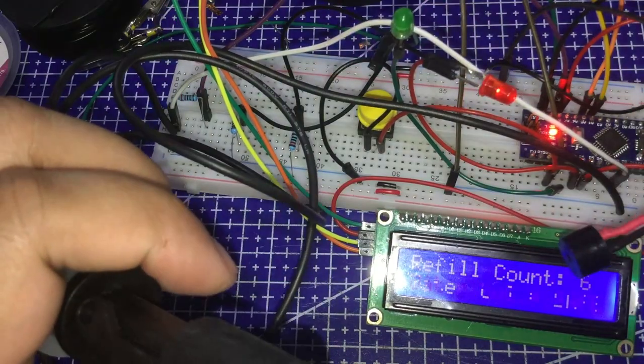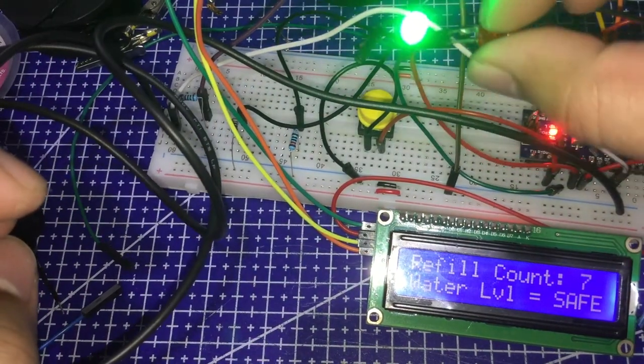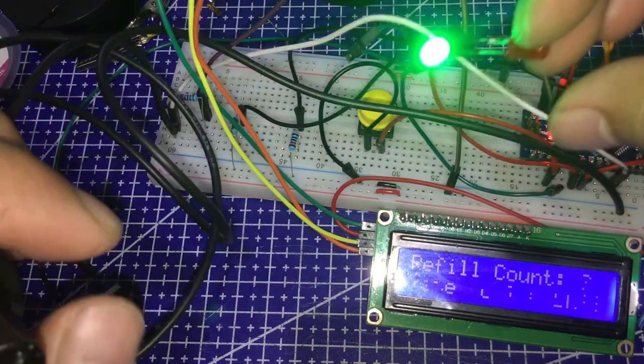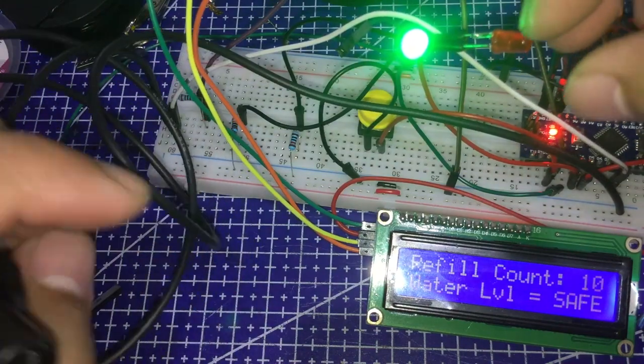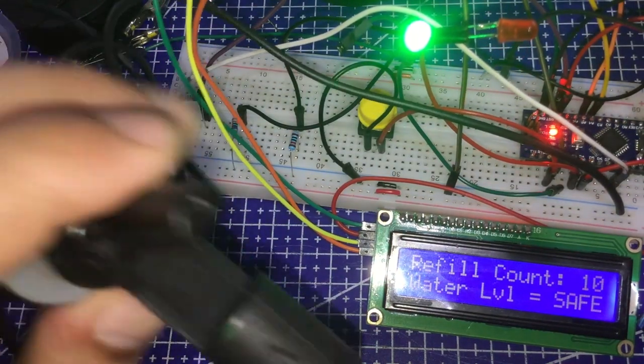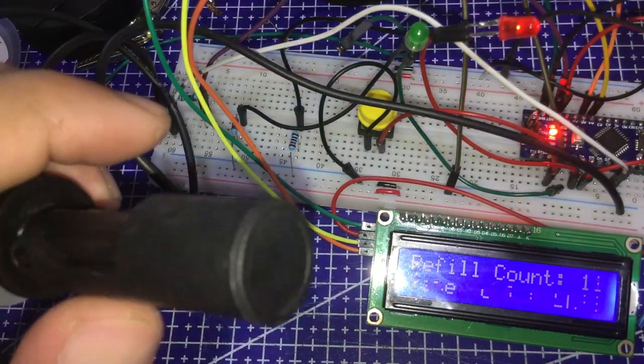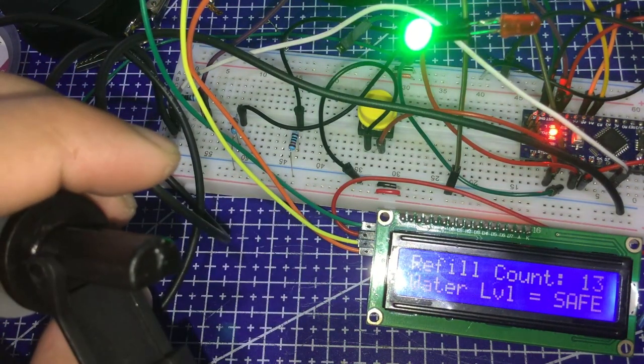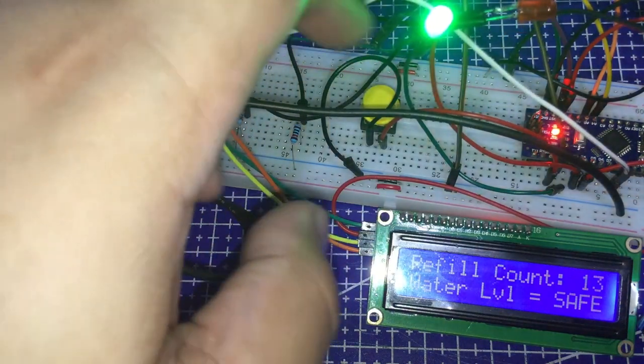The way this works is when the float switch is high or floating, the green LED is activated and refill count is recorded. When the float switch is low, or both of the magnets are connected and completing a circuit, the red LED and buzzer are activated. It's basically the same as prototype 1, just reversed. Check out the schematic in the description below.